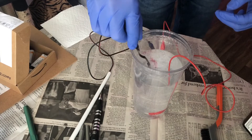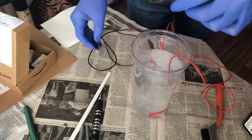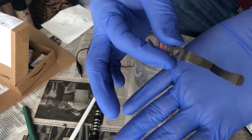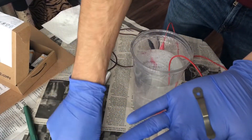You are watching me anodize right now in a solution of baking soda and bottled water — basically dissolved as much soda in there as I could. I then did a 9-volt gold base layer and then masked off certain areas with rubber cement.